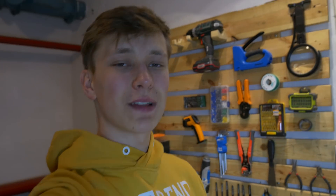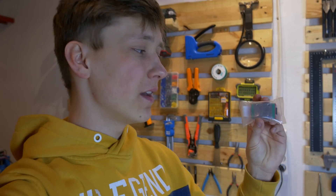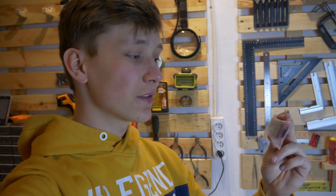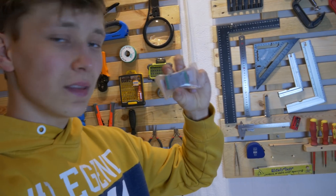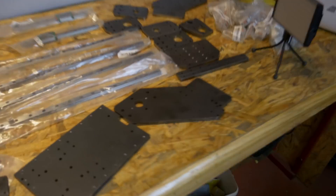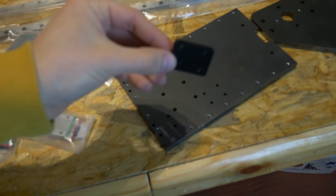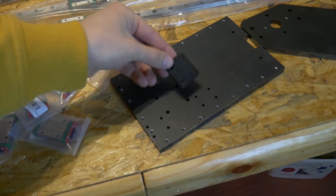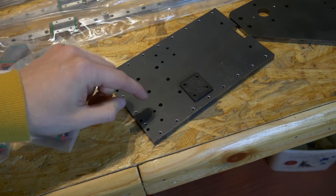It's time to start counting mistakes in this design — here is number one. There are two versions of MGN12 carriages: MGN12C and MGN12H. In my design I use the C version but I actually bought the H version. The difference is just 5 millimeters — the holes are 20 millimeters apart in the H version but 15 millimeters apart in my design. With a simple 3D printed adapter I should be able to attach it correctly and drill the holes in the proper place.